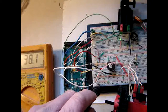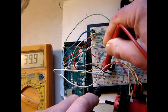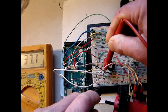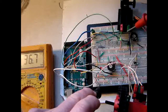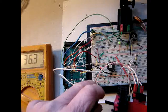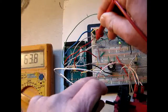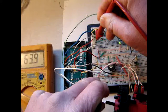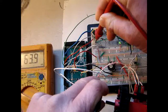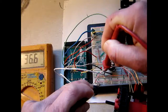Let's just put the mass here and measure safely for pin 13, and I come at about 35 kilohertz. Then keep measuring, pin 4, which is this one, that is correct. 30, it was 32,500. Well, alright, margin in measurement, close enough. Close enough.